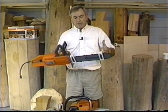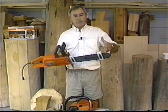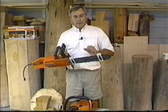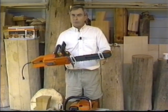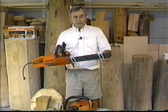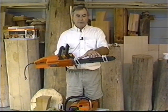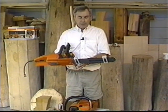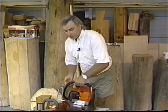And I've mounted these guides. I think we have a 12-inch spacing here. I can go down to 11 or up to 13, so I've got a little bit of leeway there. We lose about 3 inches when you combine the space of the two guides. So if we have 12 inches outside minus the 3 inches here, we end up with a net cutting capacity of 9 inches.